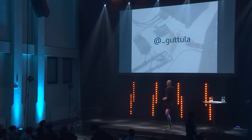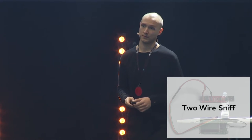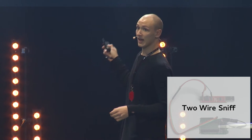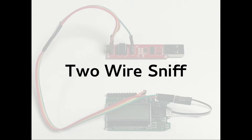Question: do you have a picture of your actual device? Yes — that's it, the DIP-8 chip, when it's not attached. When debugging, I use something that looks bigger. If you made it for real, it would be just that microcontroller with no external hardware, attaching to the serial data and serial clock lines, plus shared voltage from the battery. In reality during testing I have probes to attach voltage, but in a real scenario that comes from the battery. I removed the battery because working with batteries is hard — working with a bench power supply is easy.